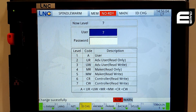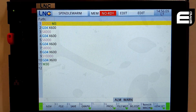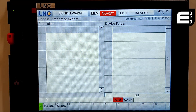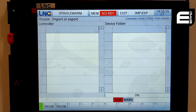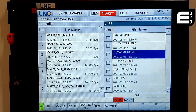This allows us to go back into the PROG screen. The PROG screen is on the menus just underneath the screen on the left-hand side, and it gives you the option of Maker Macro. Click on Maker Macro, then do Import-Export. It comes up with a set of screens. At the bottom left you will also see input USB, and that's what we need to do. On the left-hand side you see what's already in your controller; on the right-hand side is what is on the USB stick, as denoted by USB at the top. Scroll down to the macro update.